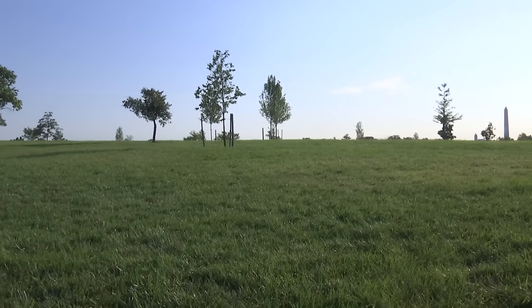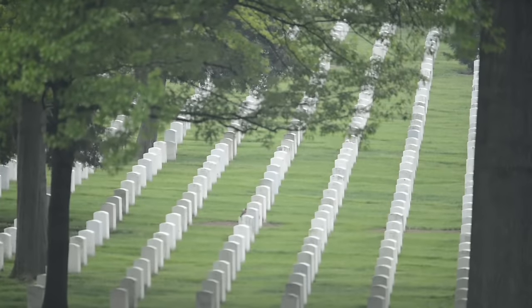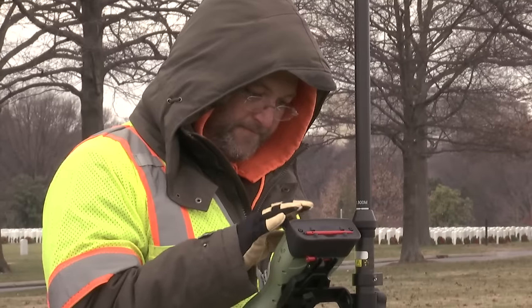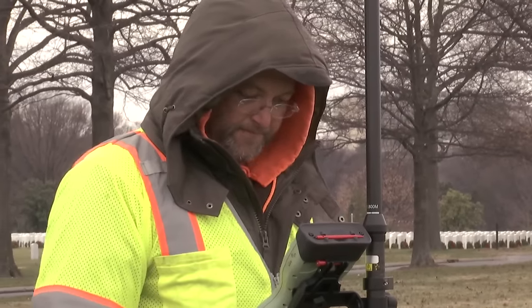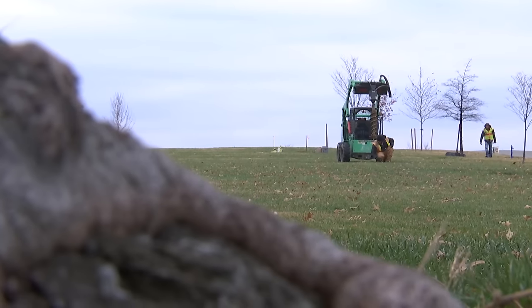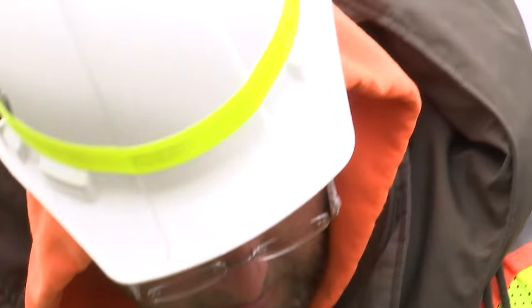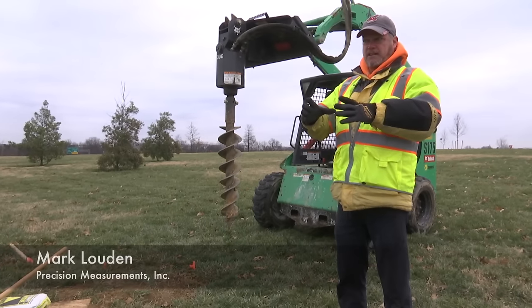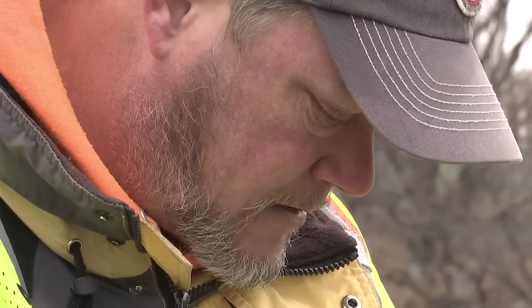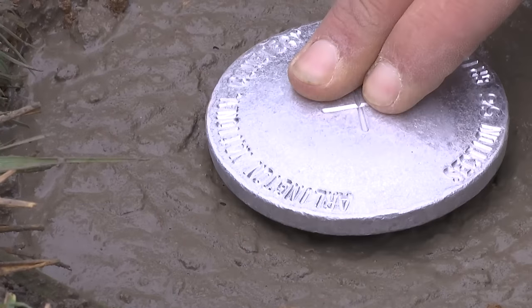So how does a field of grass become this sacred soil? The first step is crucial: positions from Global Navigation Satellite Systems. You can see here we're using 16 satellites. We are laying out grid monuments for the section. It's an 8-inch monument, made of concrete, 30 inches deep, and we'll pour concrete and set an iron pin in it.